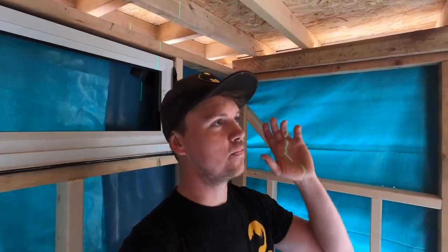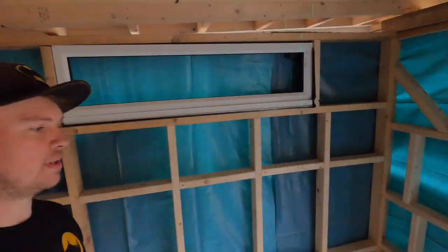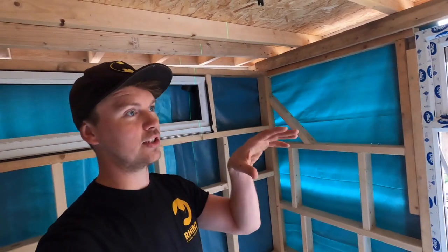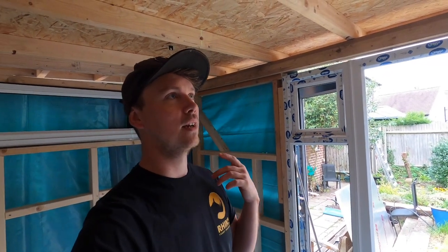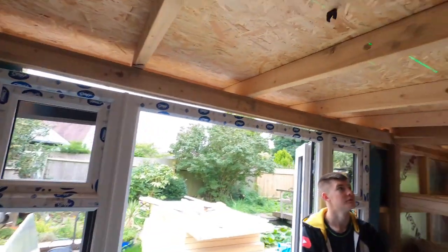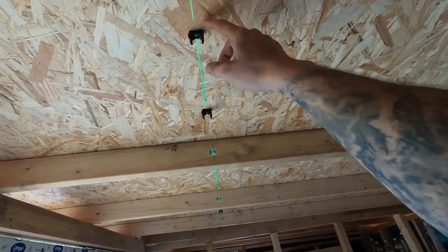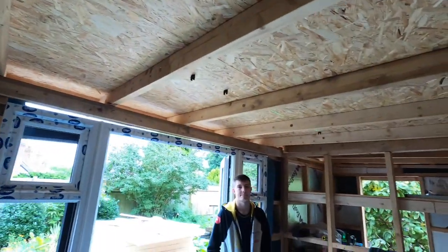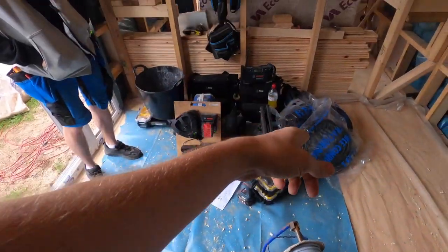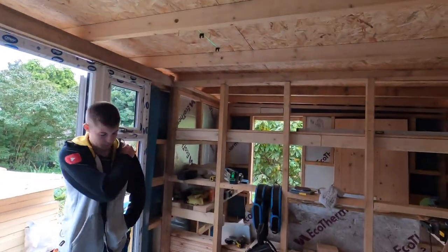With wiring places like this, you could easily clip direct around — it'd be Celotex, it'd be absolutely fine. But I'm trying to instil in Adam what could happen potentially if you didn't do what we're doing. People could say it's over the top — we don't care. It's not even taken 20 minutes to do this. What we've done: got the laser up, put some flexi-conduit saddles up, small screws that haven't penetrated throughout the wood. That's going to clip them in place. It's all lasered to the same level all the way around, so we're happy with that.